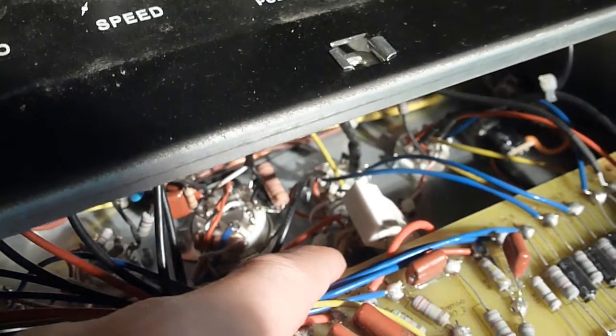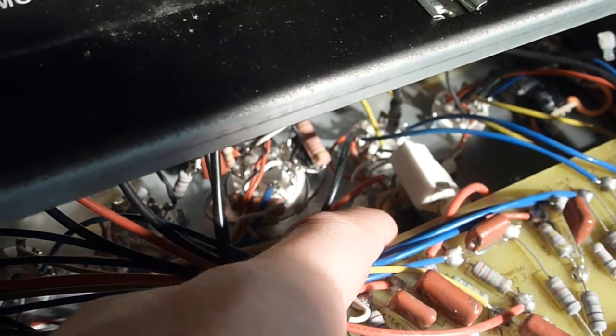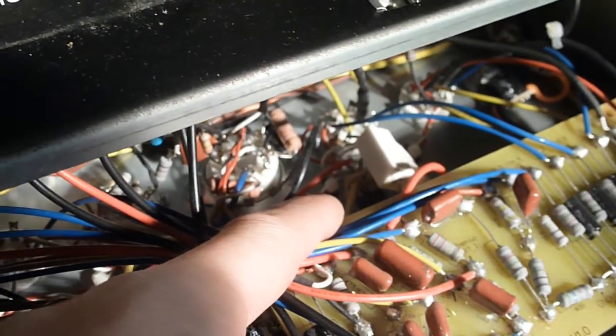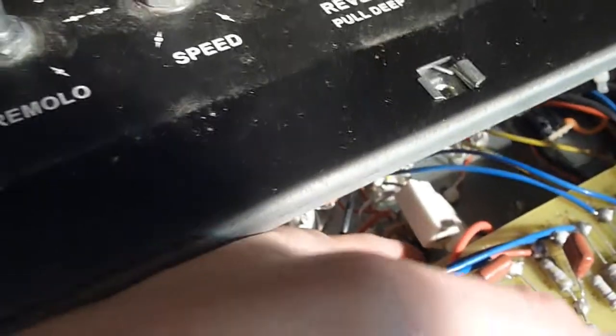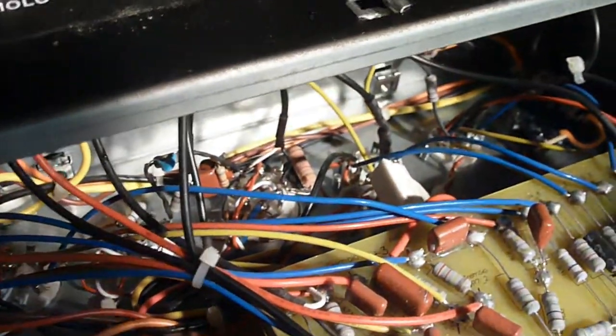In theory, this thing can drop up to 90 watts provided it can get rid of the heat from it. That's why it's connected to the chassis. So you can't simply lift it off and then see if that clears up the short. I'm thinking there's probably some sort of washer in the way, like a plastic one right there, that has melted and shorted through, or it's just punched through the mica spacer.